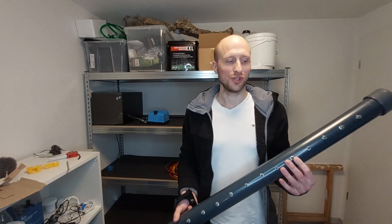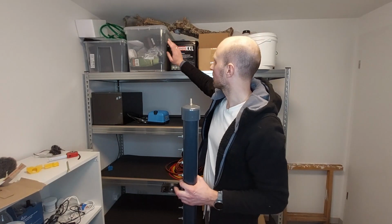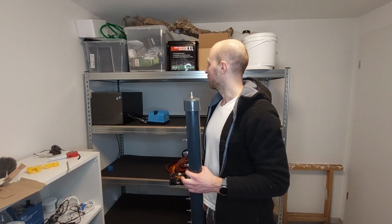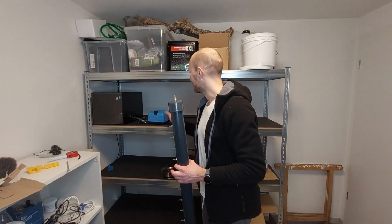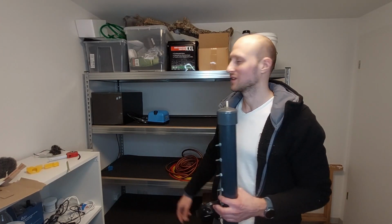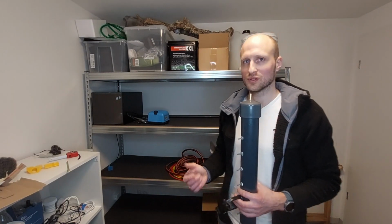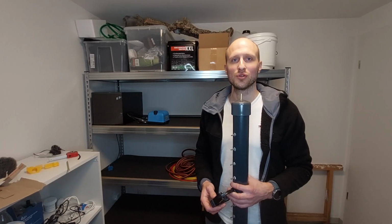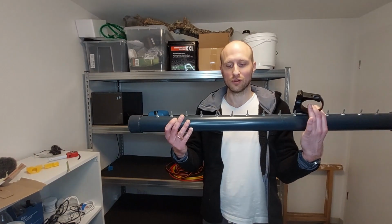And the compressor itself, I will position it on the upper level of the shelf, somewhere behind in the corner, because it doesn't look really nice and it makes noise. It's also always good to position it over the water level, because then I do not have to install these stop valves, which might have a negative influence on the airflow. So that's the plan for tomorrow. And I think the next step will be to water test the whole construction.